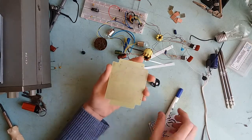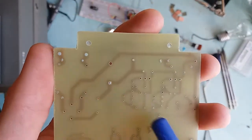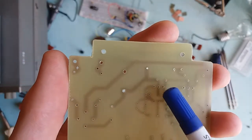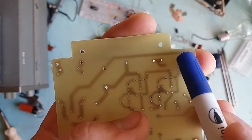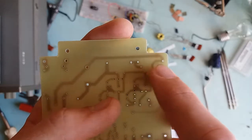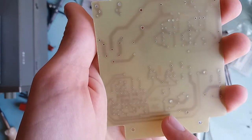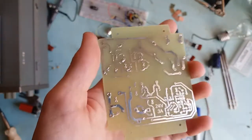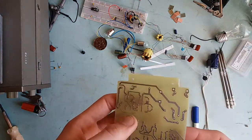There are quite a lot of components in there. This section is the shaping circuit for the bases of the transistors. Also here will be installed two capacitors that will form the other half of the bridge. This is the jumper — unfortunately this board contains three jumpers: one under the chip, a second here, and a third right there on the primary side. But that's what you get if you want to cram everything onto a single-sided board. There's no other way around it pretty much.